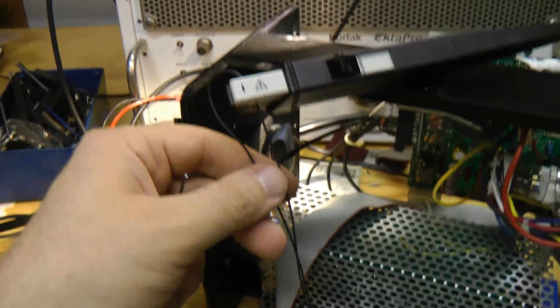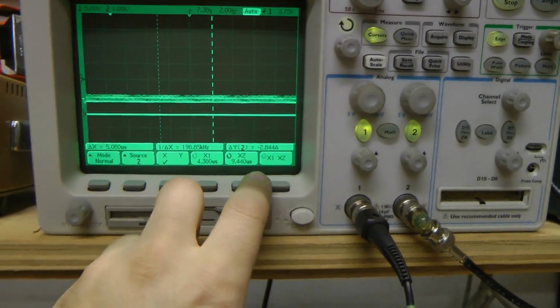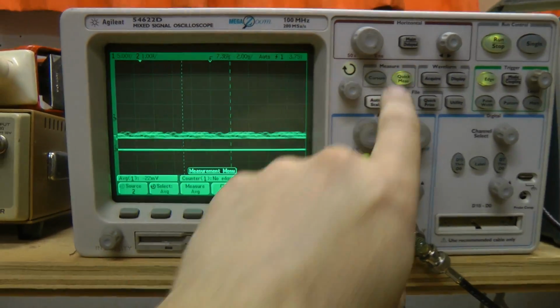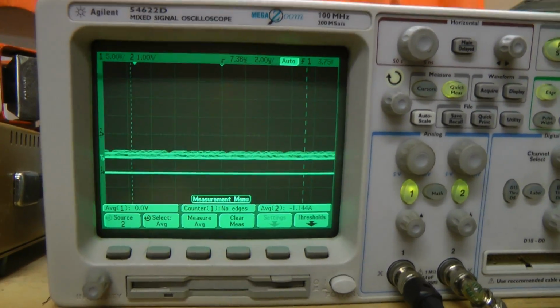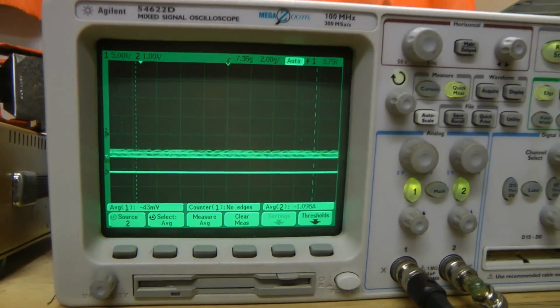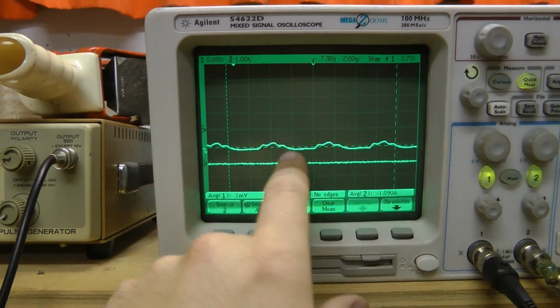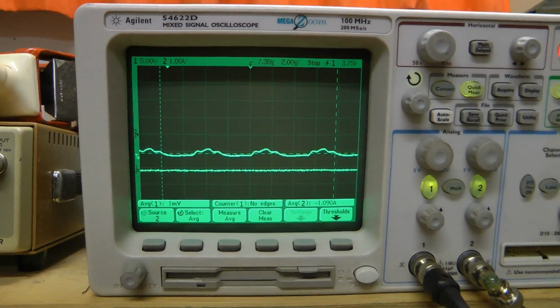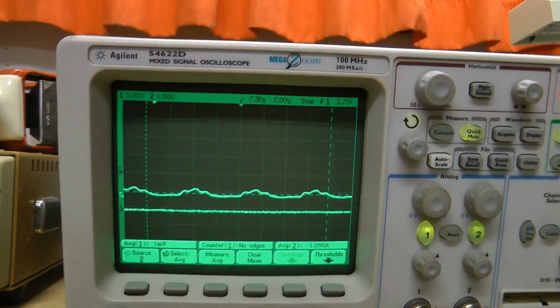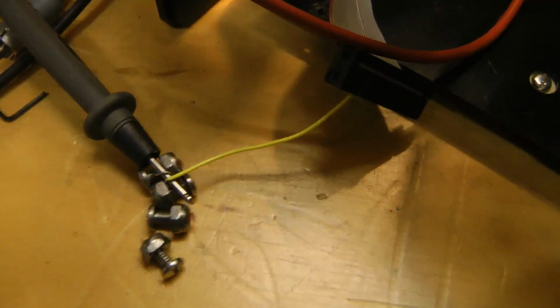Anyway, this is how to measure current. If we turn it back on, we're getting about minus 1.5 amps on the minus 15 volt supply, which is currently at minus 0.3 volts. And the frequency is synchronized to the switching regulator, so I think that's where the ripple's coming from. So something inside this module is short-circuited. From minus 15 to ground, we have pretty much a dead short.